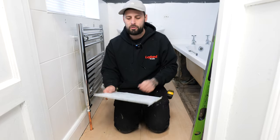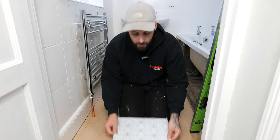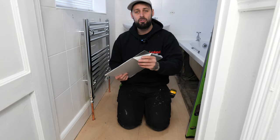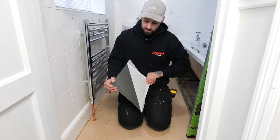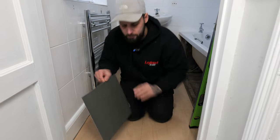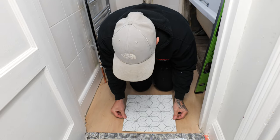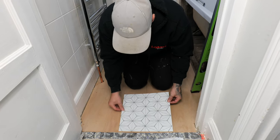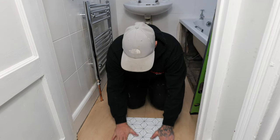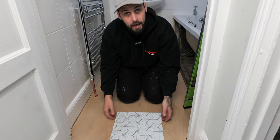It's finally time to start putting tiles down. If you're laying plain tiles, get yourself a measuring tape and mark two center lines so you know exactly where to place them — spend a bit of time on this because your whole floor comes off this. All you're going to do is peel the sticky backing off. Because we've got a center line on our tiles we don't need to measure anything — just come straight off the mark. Place it nice and loose to make sure you get perfectly on your marks, then give it a nice push down.